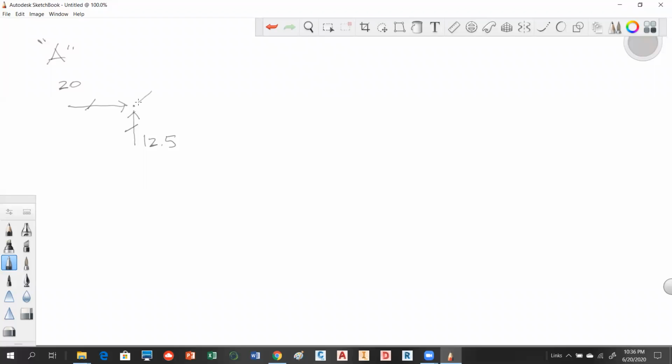If we look at this, then we have a diagonal and a horizontal member. This horizontal guy has only horizontal, so there's no vertical. So the only thing this can do is counteract that vertical. So this guy definitely has to be acting down. So we're going to call this member AB, and I'm just going to go ahead and call this negatively acting as well, and we'll see what happens. Or a compression. So both of these we're saying are in compression. So we're going to go to sum of forces in X equal to 0. In the X we have 20 minus AB horizontal minus AC equal to 0.